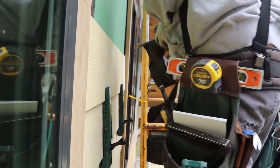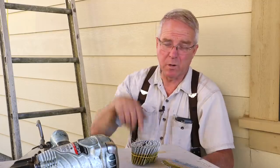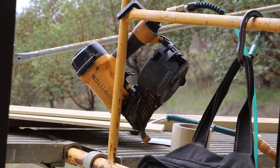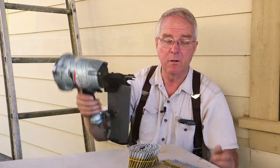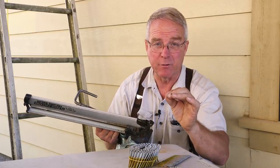When it comes to fastening this stuff to the wall, don't even try it if you don't have a nail gun. Nobody wants to pre-drill holes, and the fiber cement just blows up if you try to hand-nail it. You watched my crew use their coil nailers — they're great, you can control the depth of the set, they hold more, and you don't have to reload as often. But I have no problem using my framing nailer to put in a hot-dipped ring shank 8-penny nail, because I can adjust the set depth — and that, my friends, is critical.